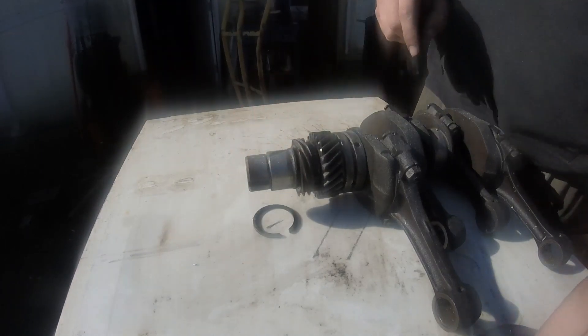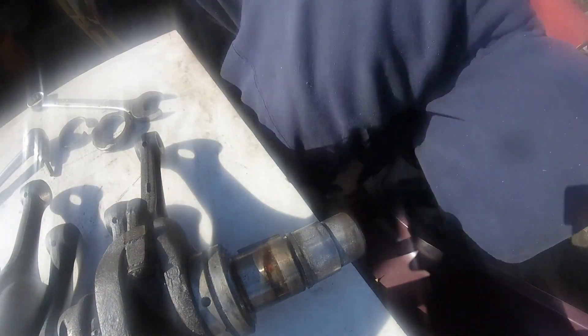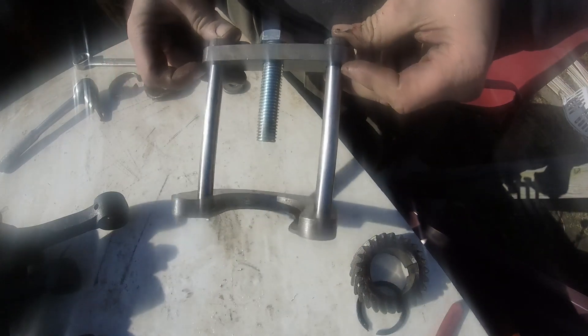You can see the gap between the crank gear and that bearing — very, very small — so you can't get a normal puller in there, which is why you have to have these special pullers. This probably wouldn't have been as hard if I had taken the distributor drive gear off first, but I decided to try pulling them both at the same time and it worked — pretty difficult though. There it is, popped right off. I've been needing one of these for a long time and getting by without it. I know they're commercially available, but I didn't buy all these machines and tools just to give somebody else my money when I can make it myself. That's it, thanks for watching.